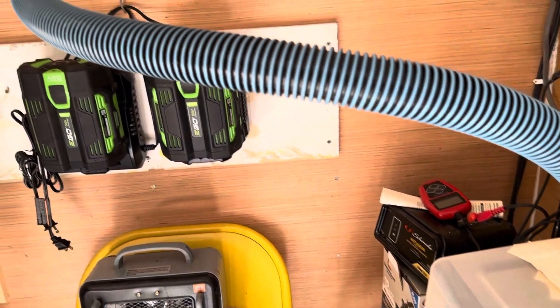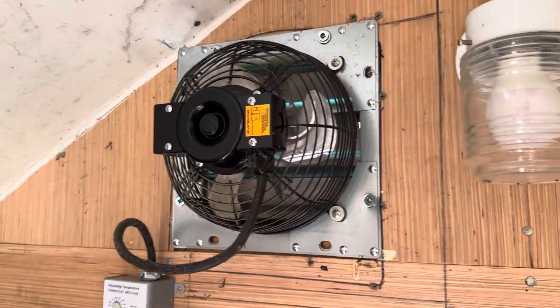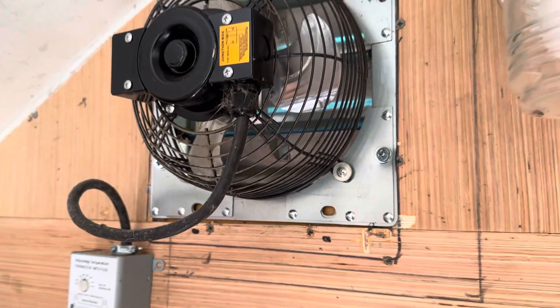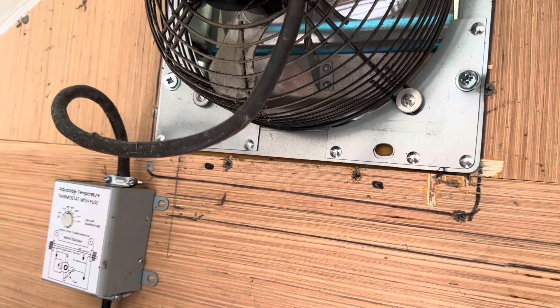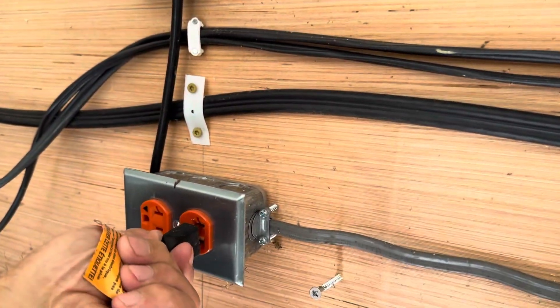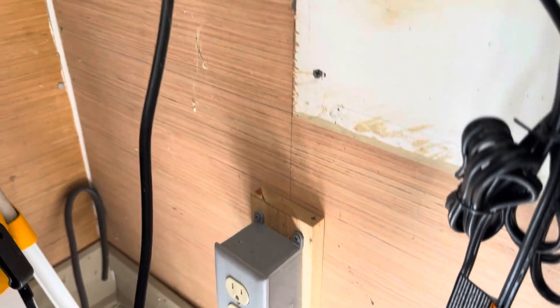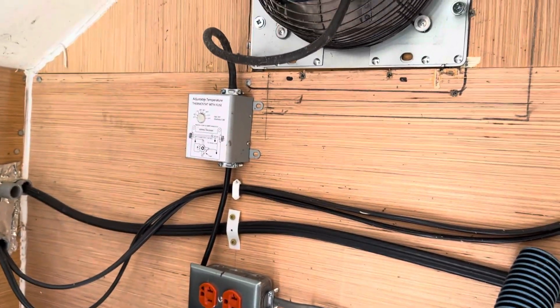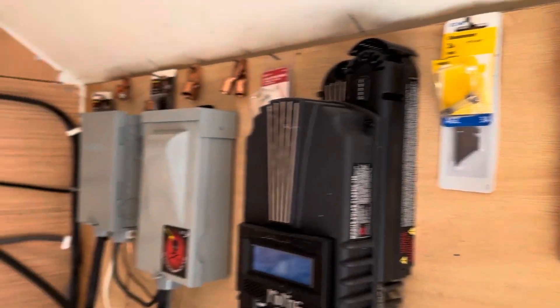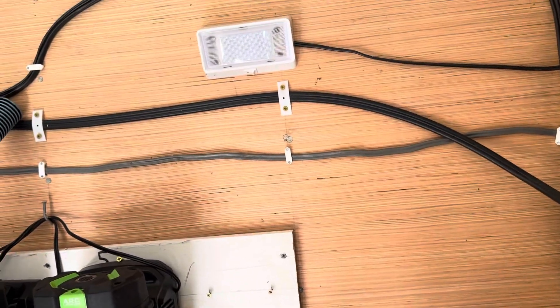In this building I also have an exhaust fan. The exhaust fan can run off solar power in the winter or summer — usually summer — but I usually plug it into grid power for normal usage to not use my battery power up. The door is also vented, which allows air to be pulled in so you don't have any trapped gases inside the building — no hydrogen gas buildup.